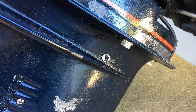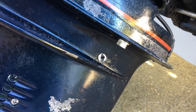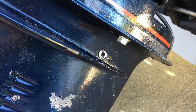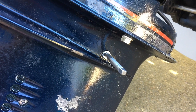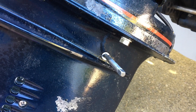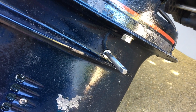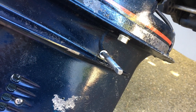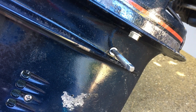I decided the next best thing would be to drill it, so I went ahead and began drilling the hole. My plan was to drill it partway through and then put an extractor in there. I put the extractor in and gave a little twist with a crescent wrench and it started coming out very easily. One important thing to remember: this is stainless steel.